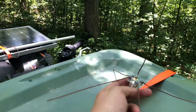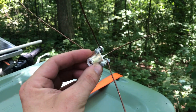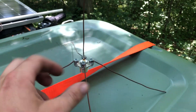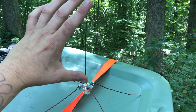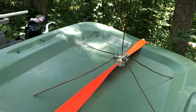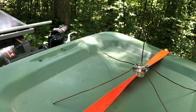I didn't show you the antenna that I made. It's a SO239 chassis mount and I just used some 14 gauge copper wire and soldered a piece on the top. The vertical is 6 and 5/8 inches long, and the radials are 6 and 7/8 inches long. That's just some formula I found online.